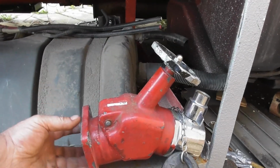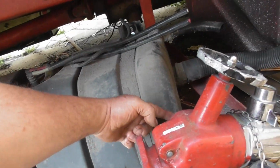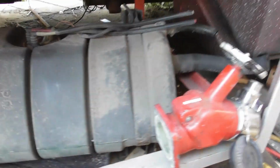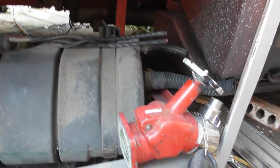That'll then be connected up to the tank, because I can get my hand in there. It means we can put a fitting through the side of the tank at the bottom. We can then seal that in and bolt it. A piece of stainless plate behind, 4 nuts and bolts will hold that in place permanently. That can then be coupled up. We can even raise that up a little higher if we need to get some gravity. So that's my plan on the water system.